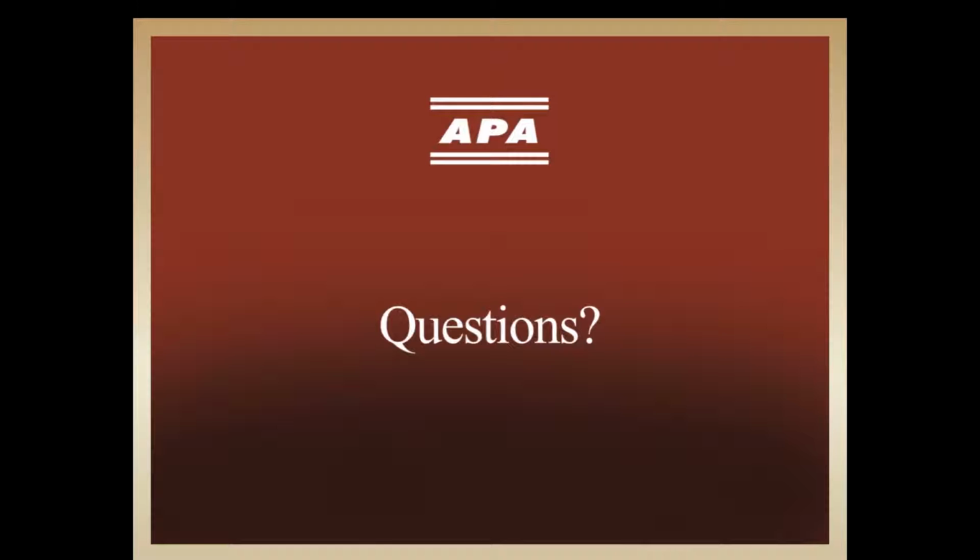Well, you know, we don't know if that material's been in the mud for 5 minutes or 5 days, so just an indication of mud or debris doesn't necessarily mean that there's an issue. But it's very hard to inspect on the job site whether we've impaired the structural integrity of the material. So I say better safe than sorry. Contact your supplier, let them know that the material's been in the water, and when in doubt, if you think there's an issue, you probably want to look at getting new material.